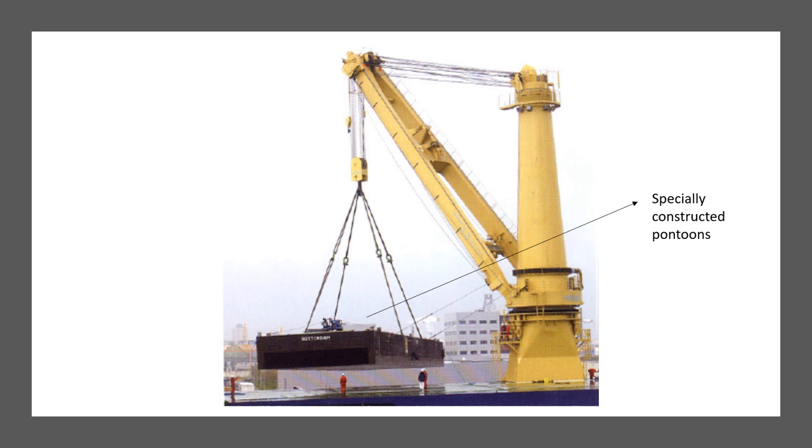Individual small items belonging to the crane — such as blocks, hooks, shackles, etc. — are normally tested at a load in accordance with the International Labour Organization (ILO) rules or the classification society rules. A single sheave block is load tested at four times the safe working load. Multi-sheave blocks below an SWL of 25 tons are tested at twice the safe working load. Similarly there are rules for hooks, shackles, chains, and rings, both below and above a safe working load of 25 tons.